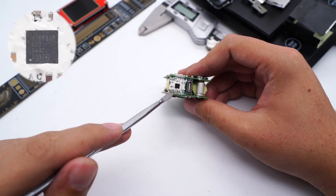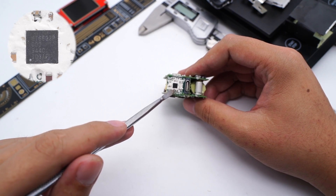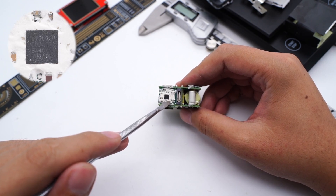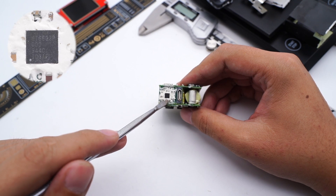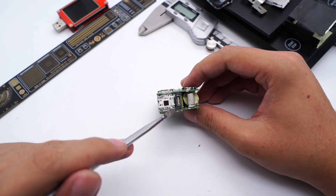The protocol chip is in the middle of the small PCB. Model is Welltrend WT6633P. It supports PD3, QC4, QC4+, and QC5, and has passed USBIF certification. It also integrates an 8051 core, output current sensor, constant voltage and current controller, and complete protective functions. This is the USB-C receptacle.